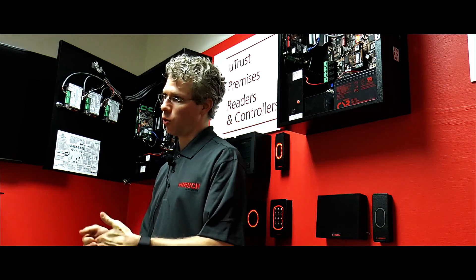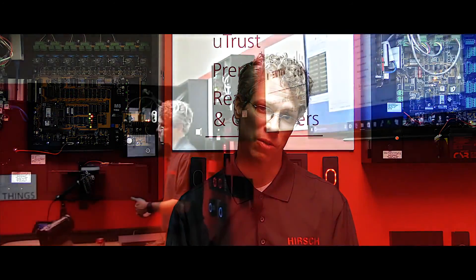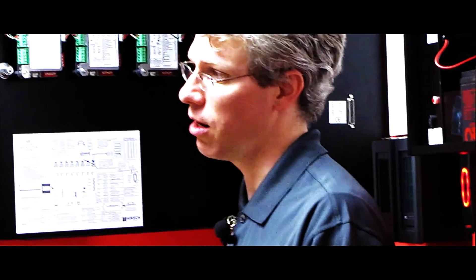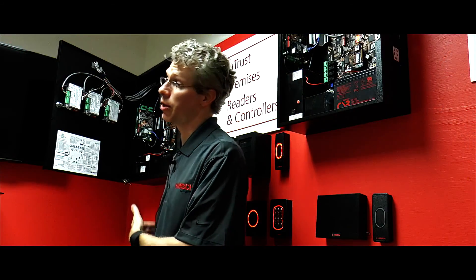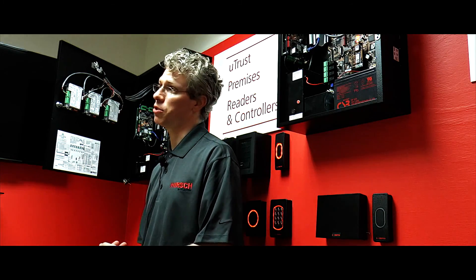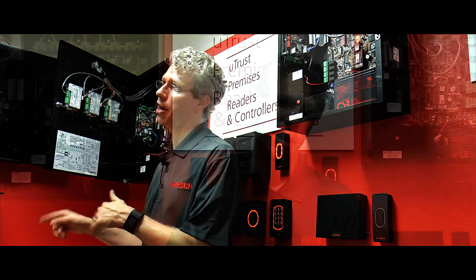The RREB board also supports eight doors, just like our model 8 could support eight doors — both in and out. That is set in the software and with a small installation tweak at the reader to designate it as an exit reader. It uses the RS485 bus, so you can daisy chain the two readers together — in and out — so you're still only pulling four wires for that single door package at the reader end.